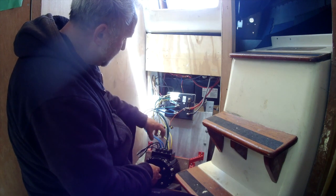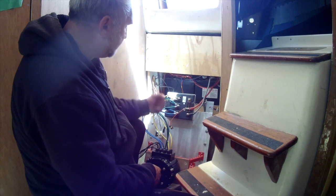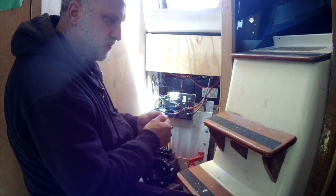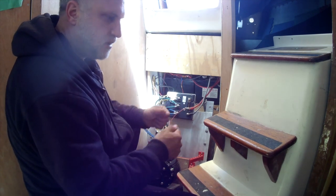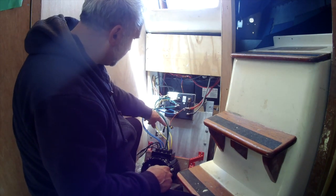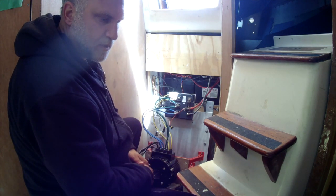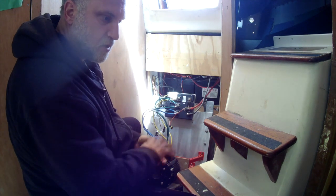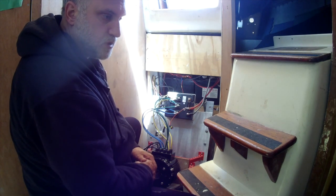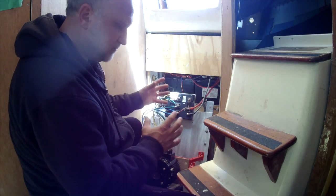The VEC500 has two main feeds. It's taking 48 volts in and the controller itself is a pure sine three-phase motor controller. It basically sends the right impulses in phase to pull the magnets or electrodes around the stators, which turns the motor. That's what controls all of that. I'm not a big fan of the software in it, but it's been working fine.